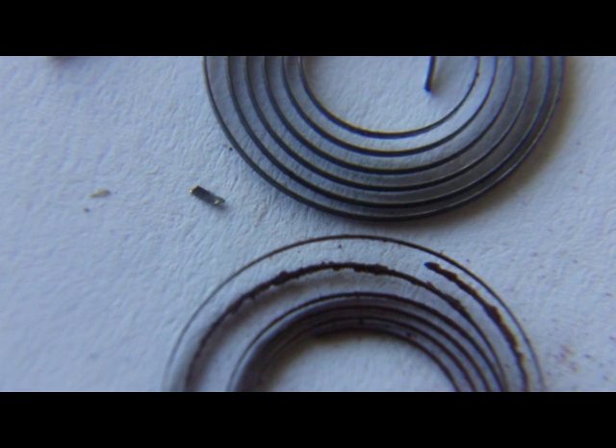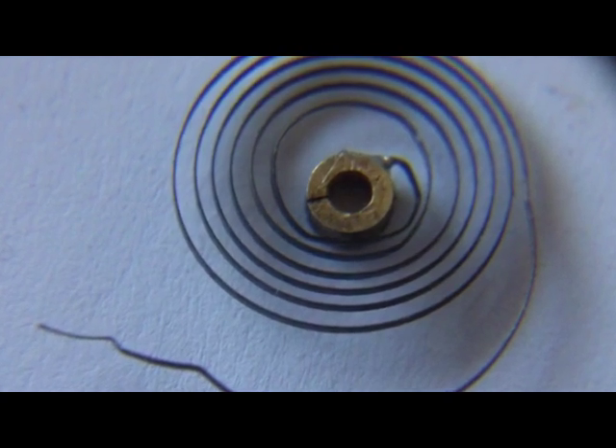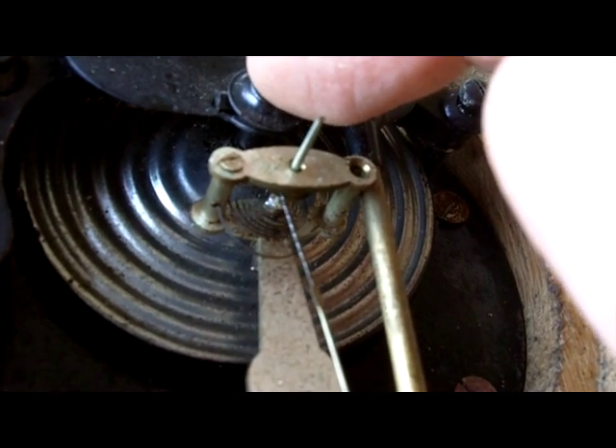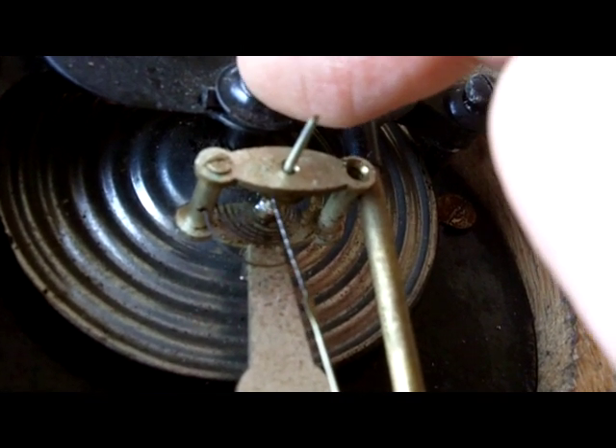It was the only one I had so I thought I'd give it a go. Here I've fixed the new spring to the old collet. I then reassembled the mechanism with the new spring in place. But what I didn't know was that I had unwittingly connected up the mechanism in reverse — I only realised this when I reassembled the dial and pointer and put it in the plastic bag. When I squeezed it, instead of the needle going up indicating an increase in pressure, it was actually going negative. So I had to take it apart and reassemble it so that it operated in the correct direction.